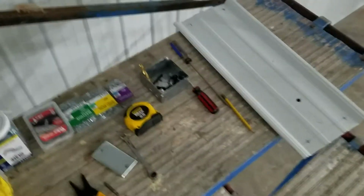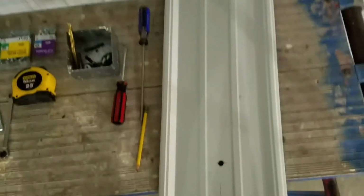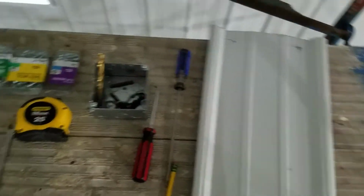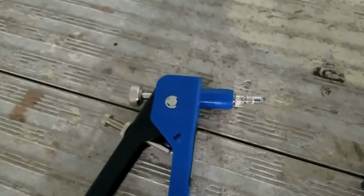And it's the next morning, and I wanted to show how we're mounting these. I've got a panel with some holes marked in it that I hold up to the ceiling. Take my pencil and I mark my scratch marks. Then I come up here, and if they happen to hit wood, I leave little bitty holes. If they don't hit wood and they hit foam or insulation, then I take my 19/64 drill, knock that out, and then we're gonna put one of these guys in there.